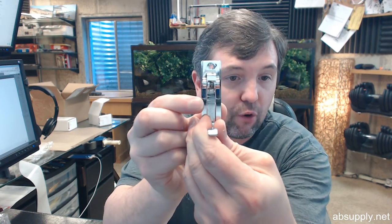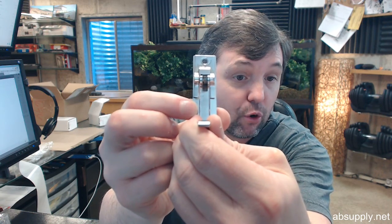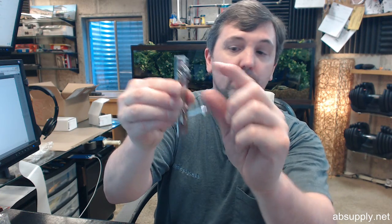I would measure the overall. These tabs don't go all the way to the outside of the face of the plate. They're quite close. This one could be pushed in a little bit to cheat out a 32nd of an inch. So I would make my preparation, the body first, like I said, from this screw hole down to this screw hole, and then I would do the depth. Okay? Then I would go back and I would do my 3/4 by 3 7/8 by my thickness of just the lip of this as the plate preparation with my router. That's how I would go about doing it.